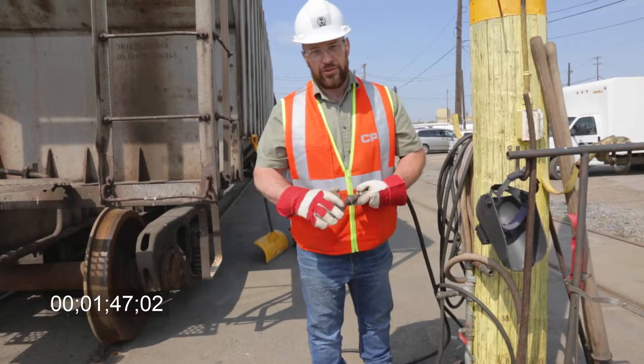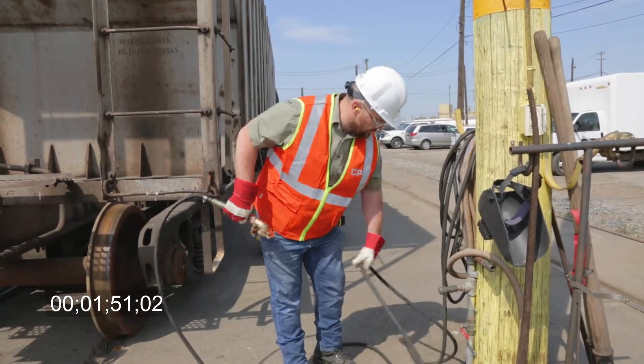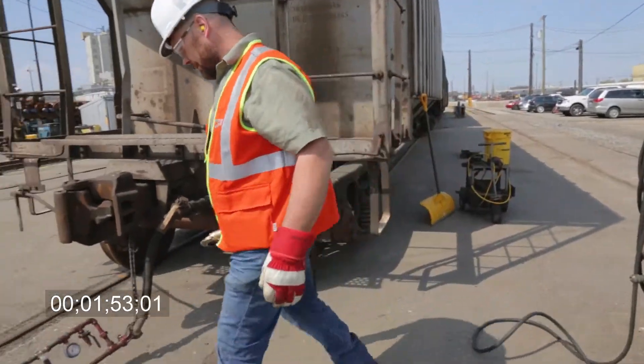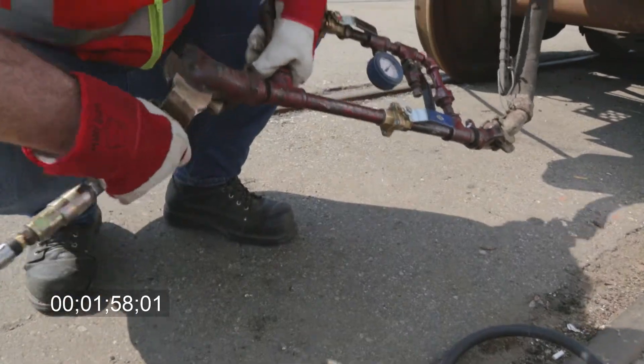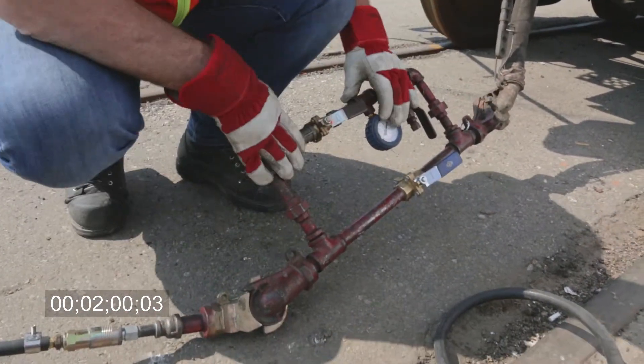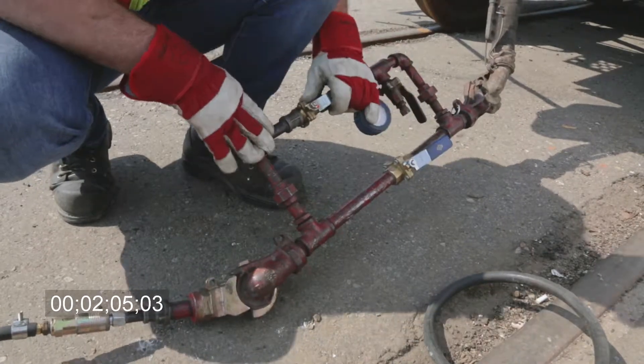Once you're sure that the moisture is out, we're going to hook it up to the yard test plant. Prior to turning on the yard air source, make sure that number one and two are closed. When you do turn this valve on, ensure that you have no air leaks and all your fittings are tight — you're dealing with a lot of pressure here which has the potential to cause injury. I'm going to turn on my number one valve right now and we're going to start the charging process.